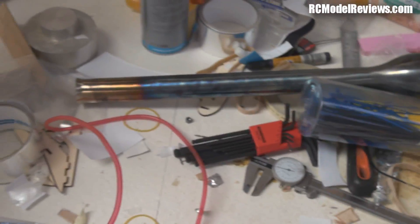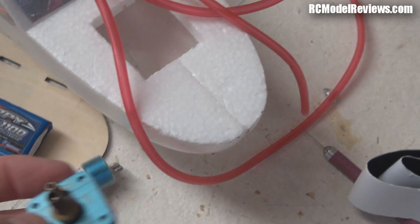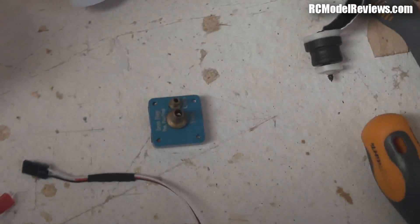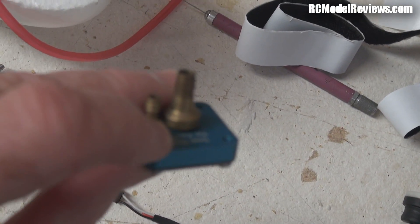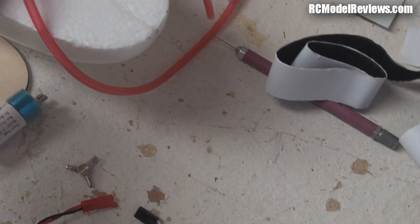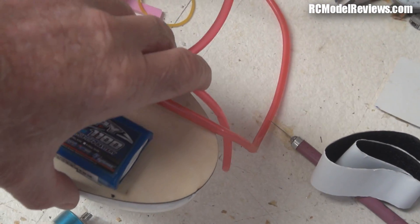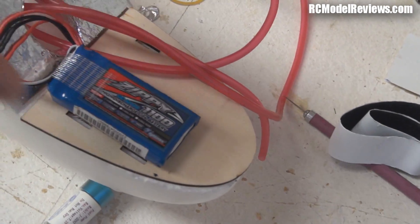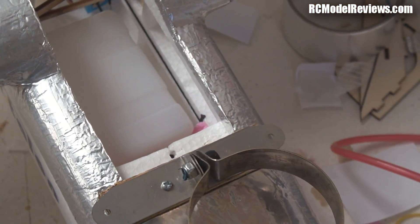The outlet of this will connect to our flow regulator. Our flow regulator has to be mounted as close as possible to the engine, because any difference in height between the flow regulator and the engine is the same as having your tank at a different height. So that will provide us with the necessaries. I'll be mounting this probably up close to the motor — I've got the plywood plate that is normally used on the HUAV here, and that's going to go in there.